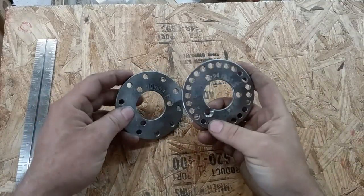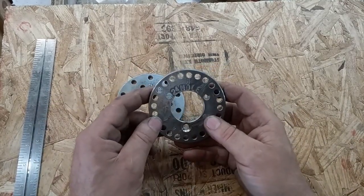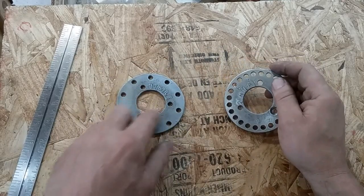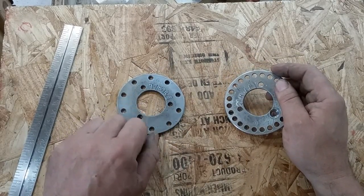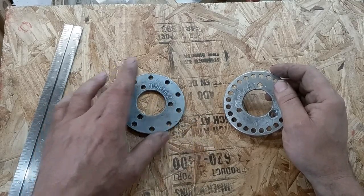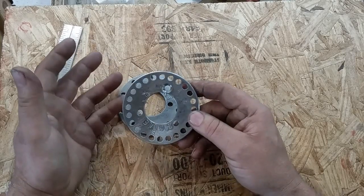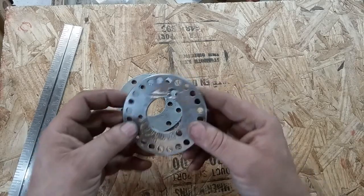So we'll start with the plates. The center hole here is about 1.5 inches. The OD on them is about 3.5. This bolt circle diameter where they mount on the Spinamajig is 2 inches diameter. The register hole is 3 inches diameter, and this one is a 24 hole. That way I can do a 6, a 4, a 12, a 24, and 8. You get the picture.